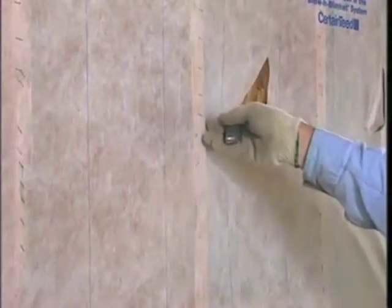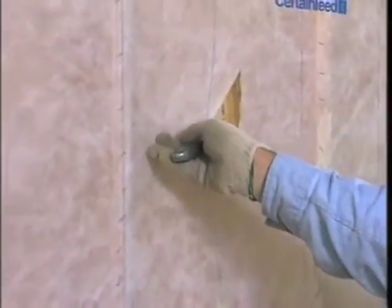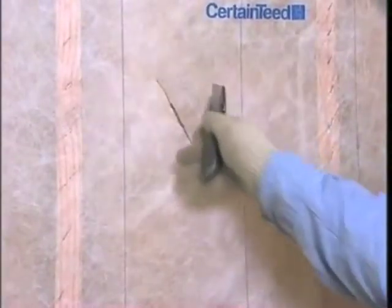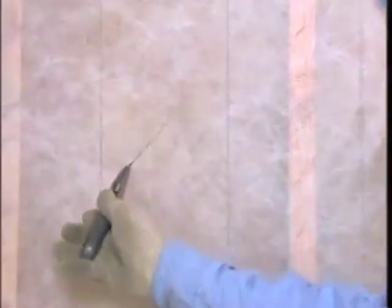The next step is to cut holes in the fabric to fit the hose end. Generally, if you're using a short hose, you'll have to cut two holes per cavity, except for short walls where you can cut one hole. If you're using a longer hose, one hole per cavity is sufficient.